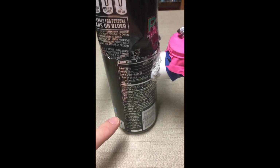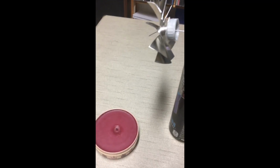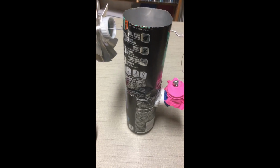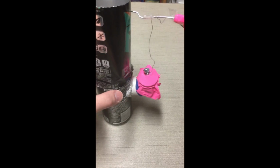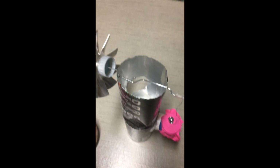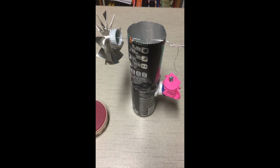And then down here we have our displacer, which is made of steel wool, and the idea is that it works off of a delta T, a temperature difference. So if I have a candle here, and then I have this, which is essentially at equilibrium with room temperature, the idea is that the heat will rise and then will heat up the displacer, which is a compact steel wool, and then that will make the thin piece of steel wire bounce up and down, which should rotate the crankshaft, or essentially turning heat energy into kinetic energy in an extremely inefficient way.